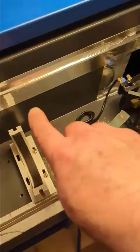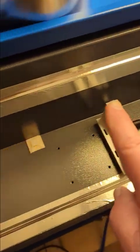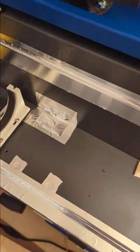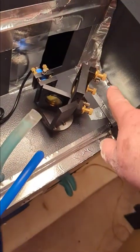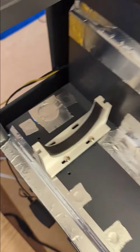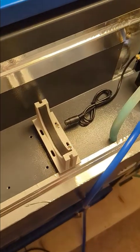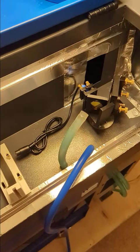The tape you see around is just to close off all the air that would flow through here. There's no reason for cooling air to go through here because it's cooled by the water. There are big gaps along here that only serve to bring smoke into this area and deposit it on the tube. I'll also put tape along here and make a smaller hole for the laser and the LED to go through.